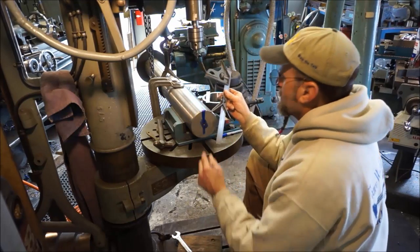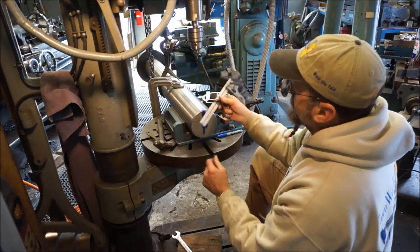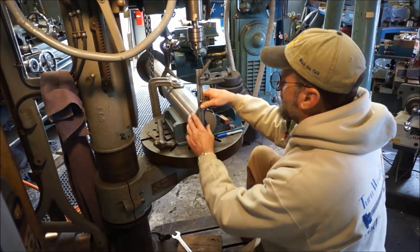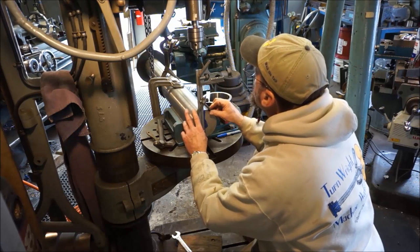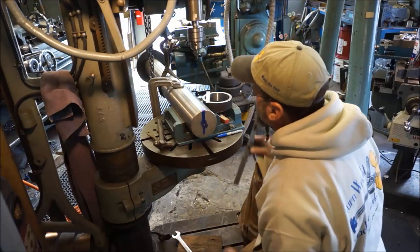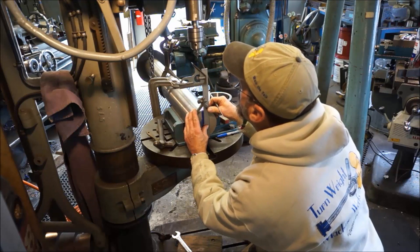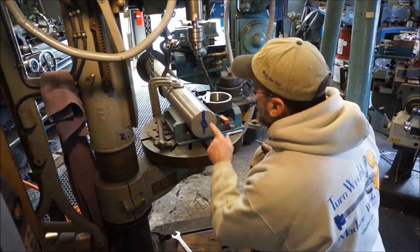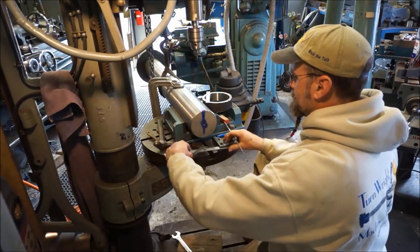Now, because we're all familiar with having a little bit off-centered edges right here, although these look like they've been machined, I know they're not quite right. They'll give you a little different line every time. So I'm going ahead and turning my unit around. I could put my Starrett's on there and I feel pretty confident with those, but the first time I didn't get a good mark here. All right, so I have about a 1/16 of an inch between those two lines, and I'm just going to split them for my other line.